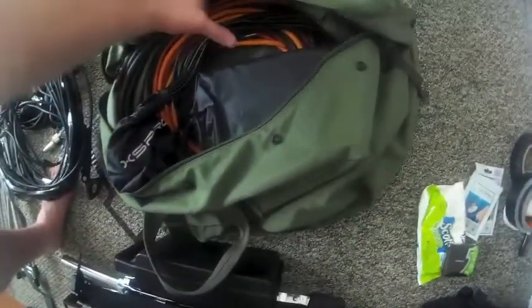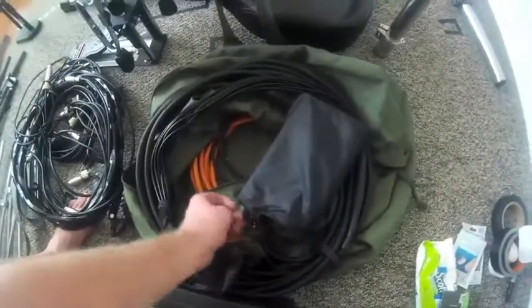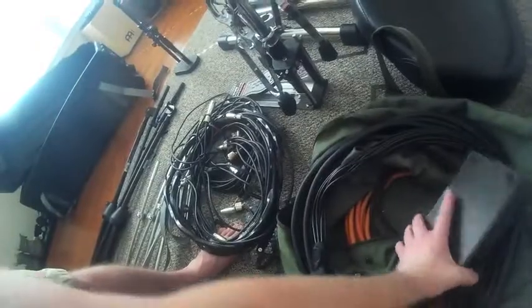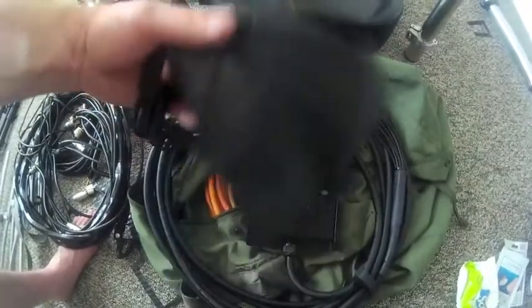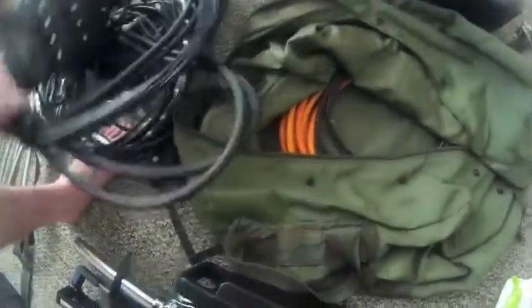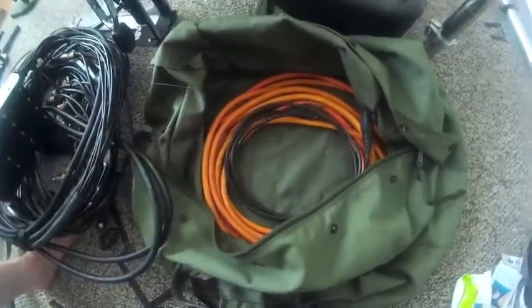When I'm not using my personal mixer, I've got this 30-foot snake that I'll plug that self-made snake I just showed you with the 9 XLRs into. These are all the input channels here, and this side is all the male XLR ends, which go to the main mixer board for the sound tech to manipulate. Typically I'll use that setup when we have a pro venue and tech. I also got the power cable for my little mixer and an extension cord to whatever power source I need.